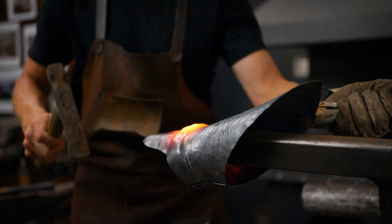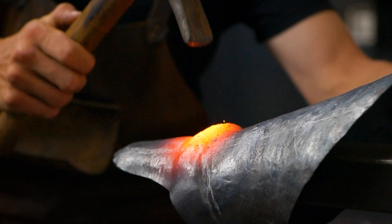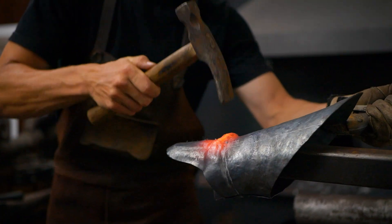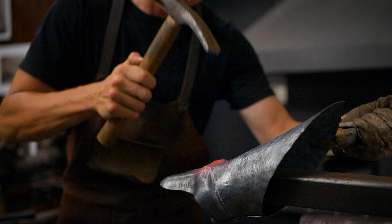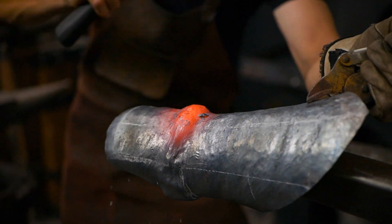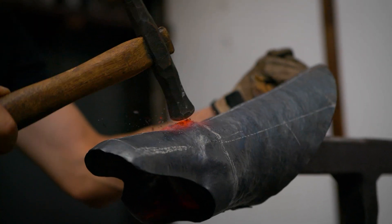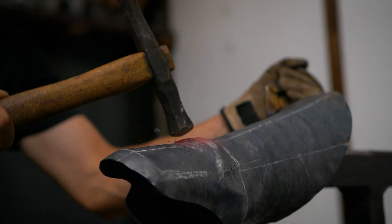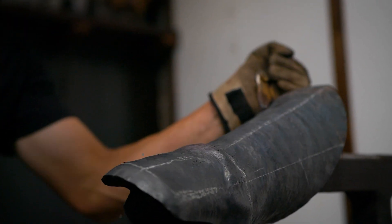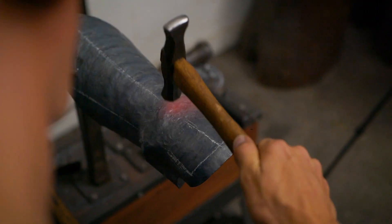Raising is the cornerstone or primary technique that we use to sculpt steel in medieval armouring. It allows us to take what is essentially a rigid and unformable medium and put complex and beautiful shape into that steel. Raising involves driving waves — known as passes — across the piece of armour. Each wave creates a step, and when chased out, creates the depth and shape in the piece of armour we're trying to create.